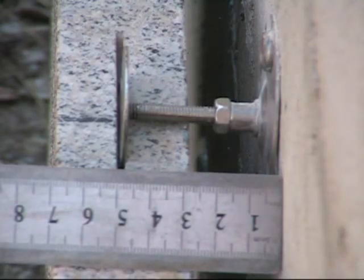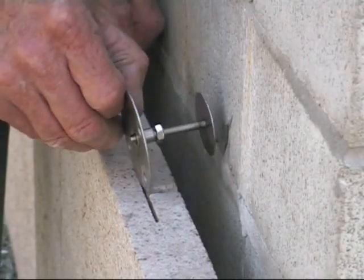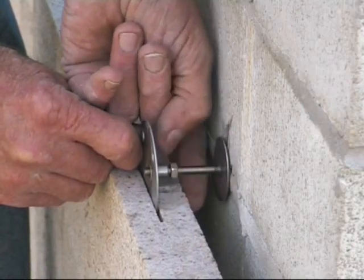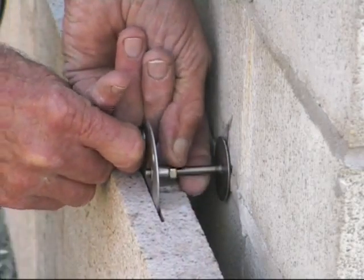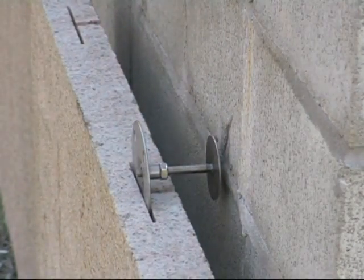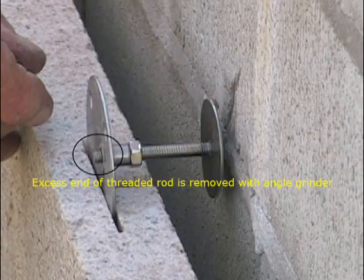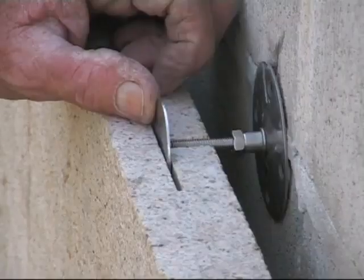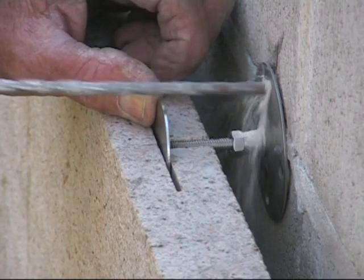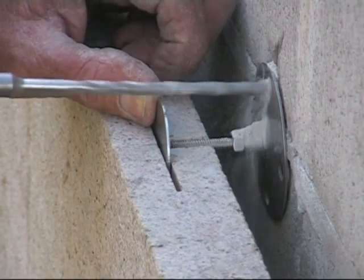When using stone clip, the curve fixing point in the stone panels allows for a softer joint and not as prone to breakage as with pin loading systems. If a panel is bumped or is jarred, it has less chance of breaking from the panel with the disc as opposed to the pin, which allows very little movement. If a panel is installed correctly, there is no load in the turning point from top to rear of the panel, hence it is centered on the front disc.